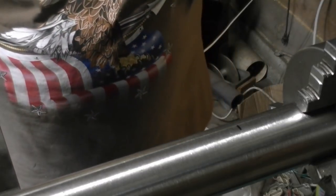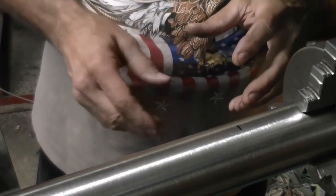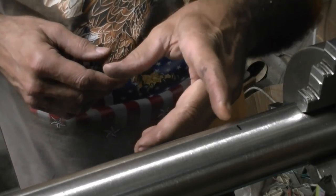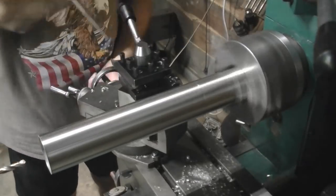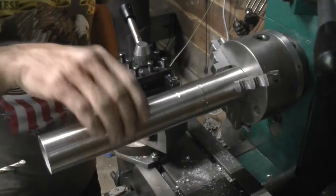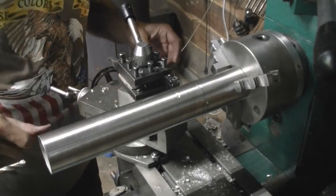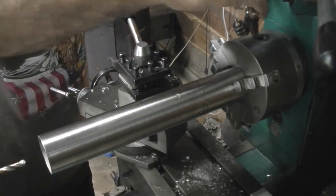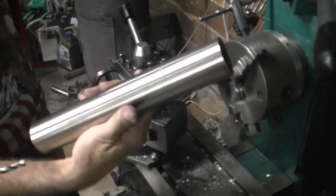I've never tried to cut stainless steel pipe before, and I don't have very good equipment for cutoffs — that's the hardest thing for me to do on this lathe. More than likely I'm not going to get this cut off with the lathe. I'll just score it and take it to the bandsaw so at least I'll have a good straight line. At least I have a good straight line now all the way around — you could have wrapped paper around it, but you can't hardly beat this.